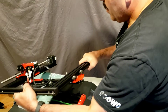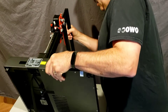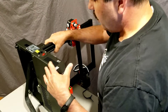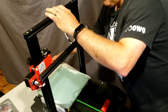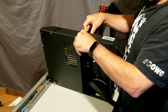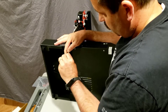Dump the bolts and nuts into the little tray — handy to have. Make sure front is facing front — you can see the hot end coming out towards the Anet sign. I'm going to speed up this chunk of video because it's simply putting four bolts through and lining them up. Dangle the parts over the edge so it stays flat and is much easier to line up. Don't tighten the four bolts until you have them all started, then lock them all in place.